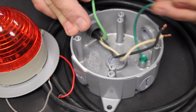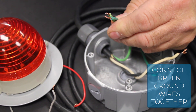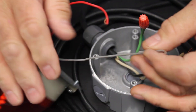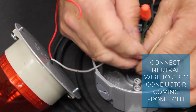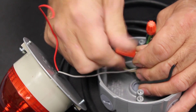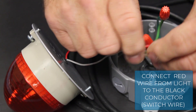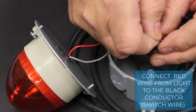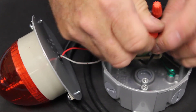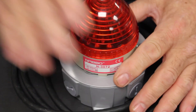The light has a metal enclosure so we'll need to ground it — we'll connect our green ground wire from the cable to the green ground wire in the light using a wire nut. There are two light wires; we'll connect the neutral wire to the gray conductor coming from the light and screw that wire nut on, making sure both wires are secured. Then we'll connect the red wire from the light to the black conductor, which is the switched wire coming from the BMRX. Screw that wire nut down tight, tuck the wires away, and put the cover on the light.